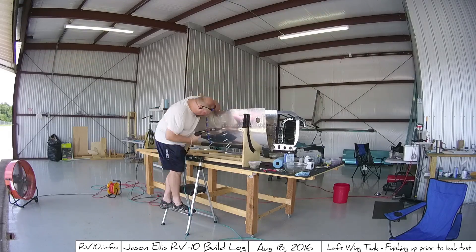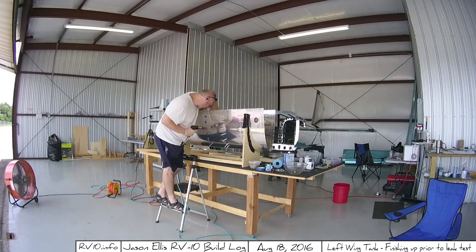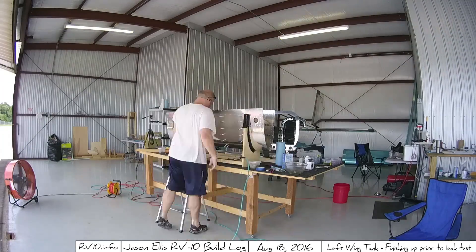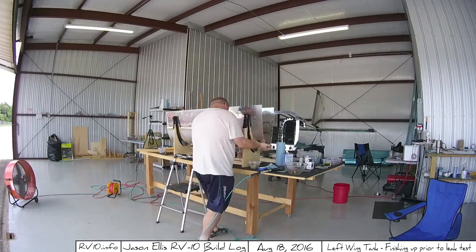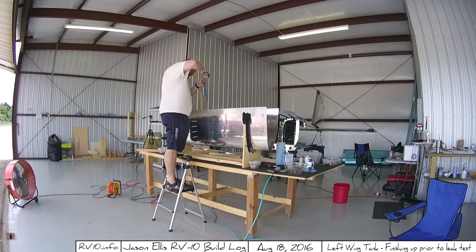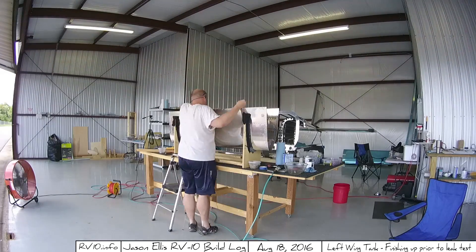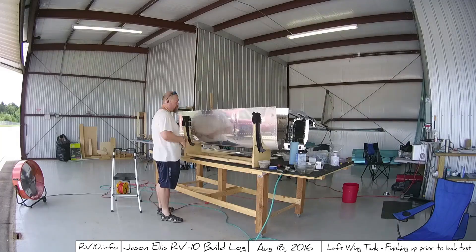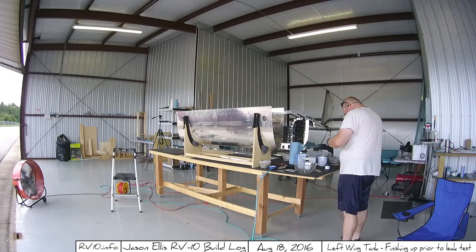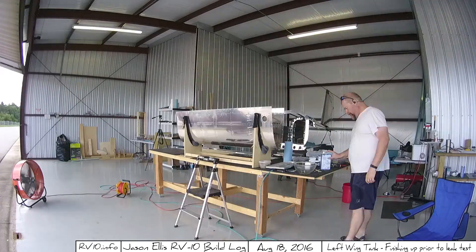Other things to take into consideration during this portion of the tank work: you're going to need ways to manipulate aluminum tubing. There's a vent tube that you'll see here in a bit, and you're going to need a way to cut it — so a miniature tube cutter, it is a one-quarter inch tube. You're also going to need a way to bend it, because if you try to just bend it over, it will crimp. You need something that will make nice smooth bends.